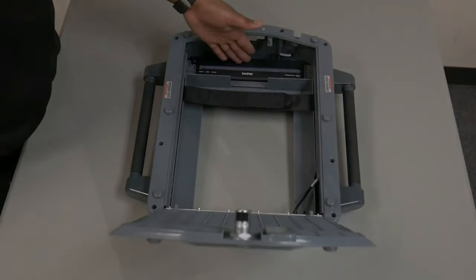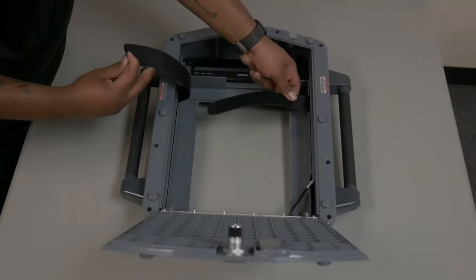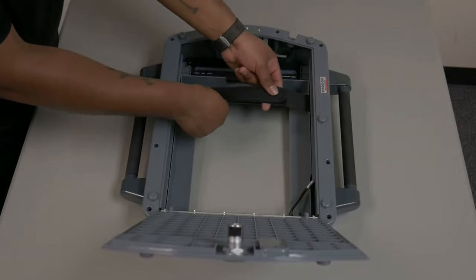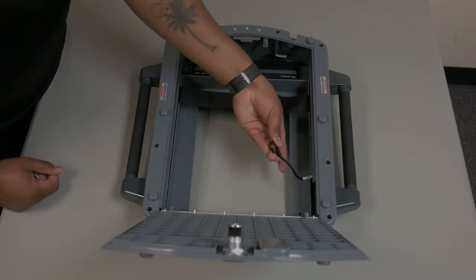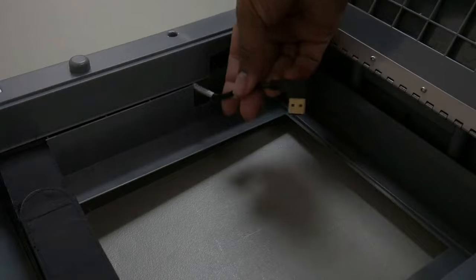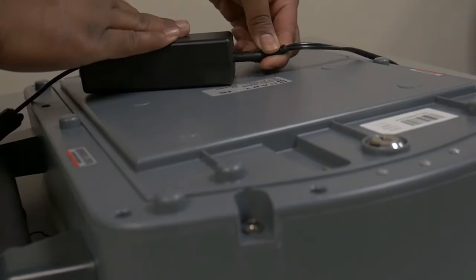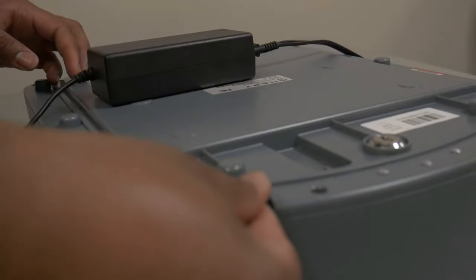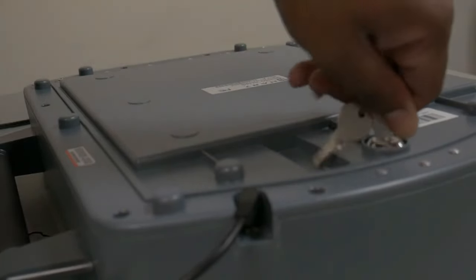Inside the Duo Go, at the top is the printer, which allows a voter to print their ballot without the tablet being attached to a base station. There are three lights: Power, Data, and Status. Below the printer is a Velcro strap that holds the curbside Duo tablet in place face down while in use, with the strap running across the rear of the tablet. In the bottom right is a short USB cable that allows the Duo tablet to communicate with both the Duo Go's printer and the ATI module port. To set up: place the Duo Go face down on the Duo Go table, connect both ends of the power cable, connect the cable to AC power, and plug the other end into the Duo Go's charging port. Open the rear with the tagged key and verify that the printer is charging.